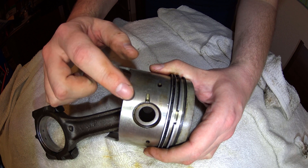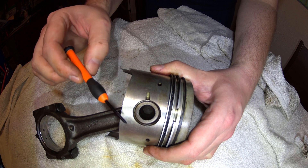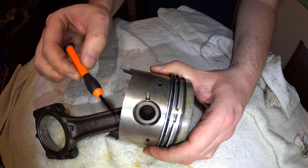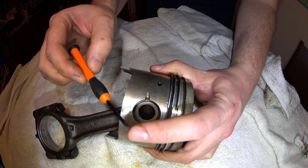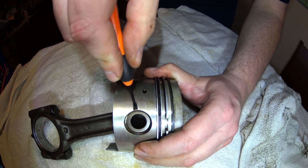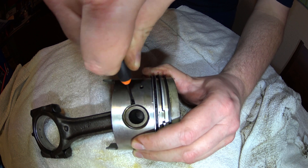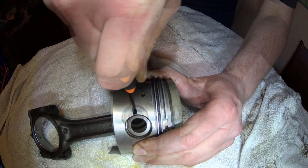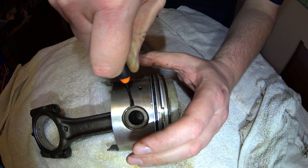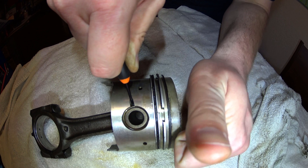To remove the circlip, all we need is a small screwdriver. Don't use one of your expensive precision screwdrivers for this because you have a potential of bending the tip. To remove the clip, take your screwdriver and push it down into this slot right behind where the clip is and push just as hard as you can. Once you get to this point, stop for a second, because if you don't figure out how to captivate this spring it's going to come shooting straight into your eye.